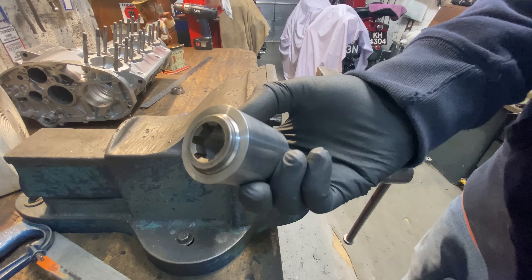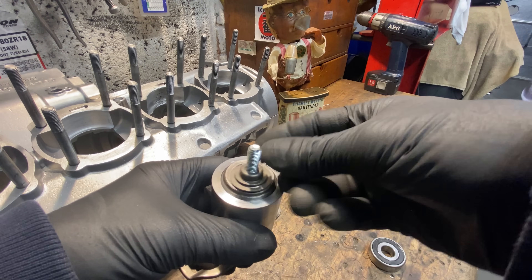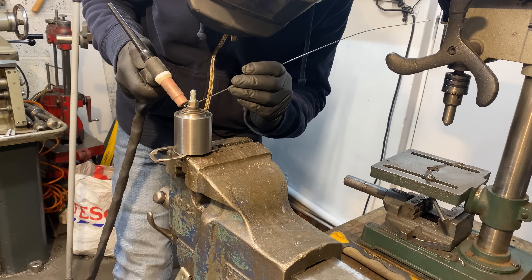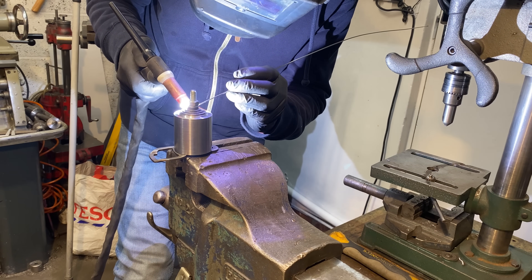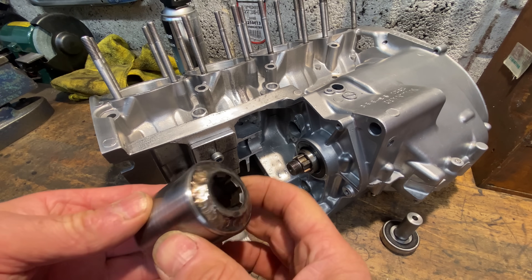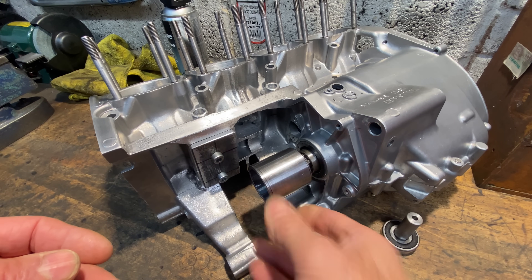It's a really tight fit, just what I wanted. So the next thing I'm going to do is bolt the parts together as well, because these are going to be welded and I don't want them moving. I weld the two parts together using my TIG welder. With the welding complete, I let the part cool down, offer it up to the gearbox shaft, and it fits perfect — I'm really pleased with that.